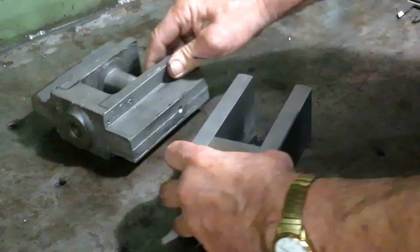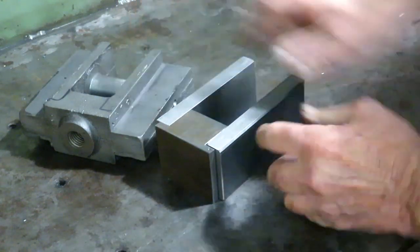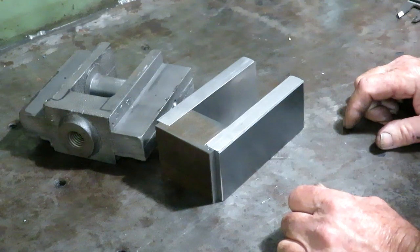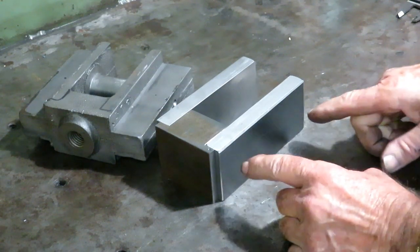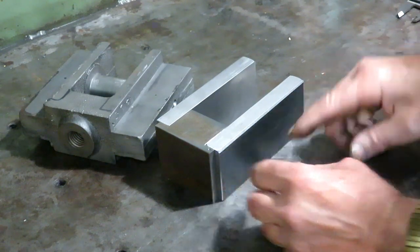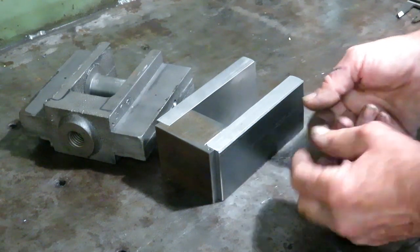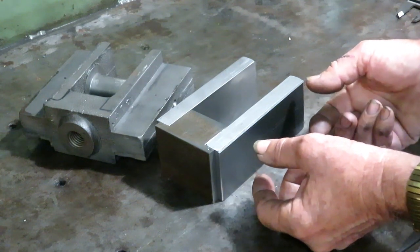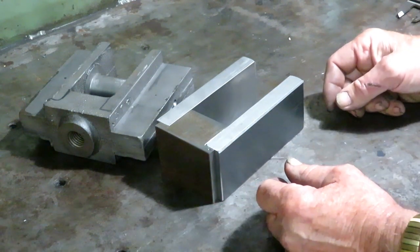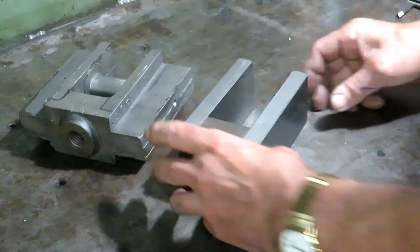And then these side pieces here, I'm going to machine them up as blocks that will go on each side with two bolts. Now I've got another engine that the crosshead is made exactly that way, and it's been a great little engine, and it's run for years and years. And in fact, the other day I took it apart to see how it was made. So these side pieces that run in the slides are going to be bolted on here, and I'm going to cut a key groove along each side and put a tongue on the other piece, so it'll fit in there, a tongue and groove, to give it a little more stability. And then of course bore this end out and tap it for the piston rod threads. So that's the plan, and we're going to see how it works. And this all may be part of a good design in the end for a production engine.